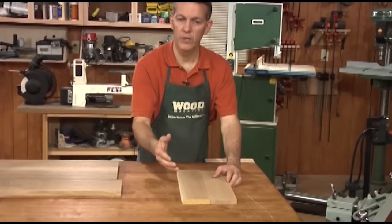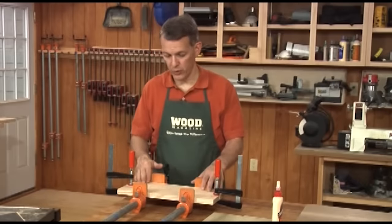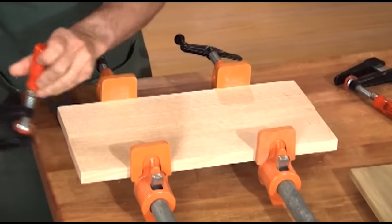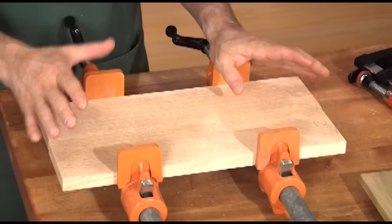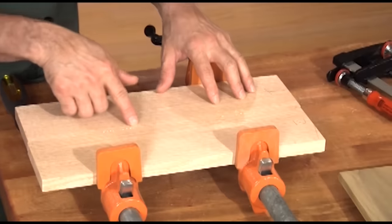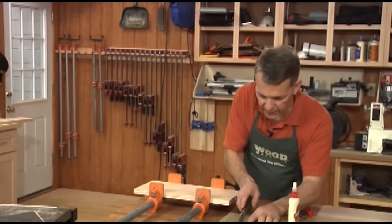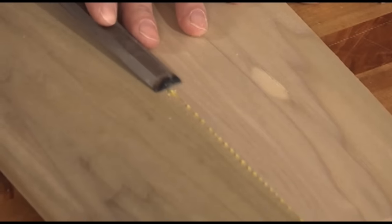Then you can go ahead and glue this up just as we did with the other panel. It's been about 20 minutes since we first glued up this panel, and I want to give you another tip on your glue ups. Glue is starting to set up by this time. You want to leave the glue up in the clamps for at least an hour, even longer if you can. However, we talked about the little bit of glue squeeze out that occurs along the joint line — you want to get rid of that before it cures too hard. Back on this panel we broke, I left that bead in place and glue dries very hard.